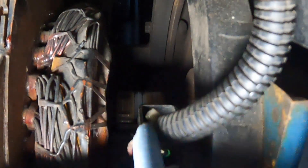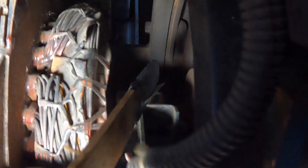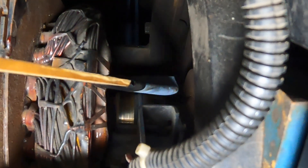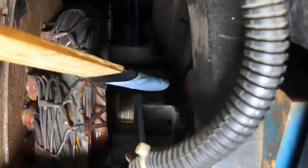After fixing that fuel return line, the engine ran way smoother — never had a problem after that. It's been running for some time now. Right now I'm cleaning the armature — this is the exciter arm, where the brushes touch, right here on this brass area. 12 volts goes through the generator and creates the electricity for welding and other electrical needs. I'm using 400 grit sandpaper and touching it very lightly, just taking the glaze off that brass area to help it get better contact.